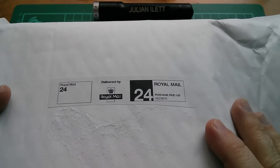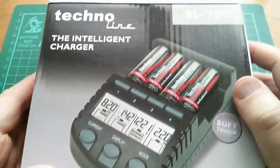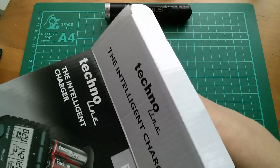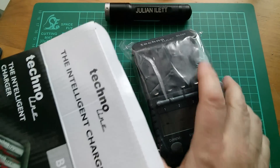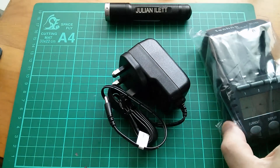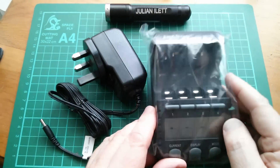This one turned up this morning, just Royal Mail, so delivered locally. In here there is a Technoline BL700 battery charger. Inside there is a set of printed instructions for that battery charger. Now I've already got two of these and I blew one up because these take three volts - but I don't think this one does. This one says DC 12 volts. So it looks like they've changed the power requirement for the BL700 from three volts to 12 volts, and this is a 12 volt power supply. They've also changed the socket - this has got one of these small connectors, not the 2.1.